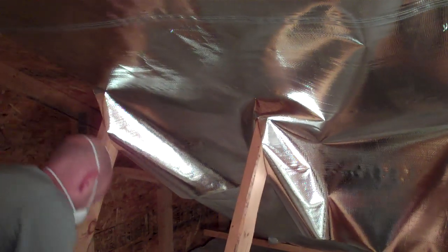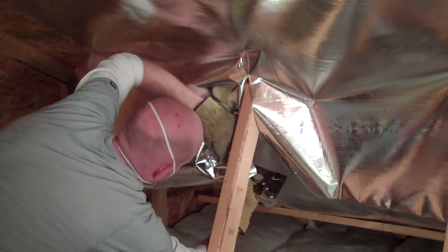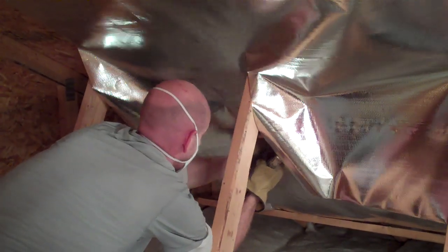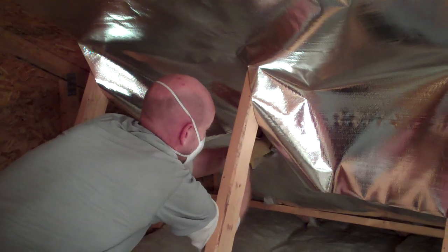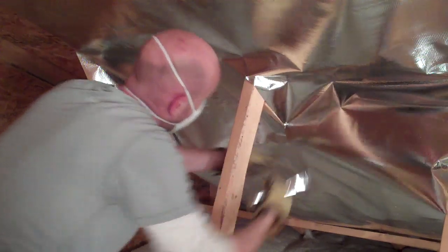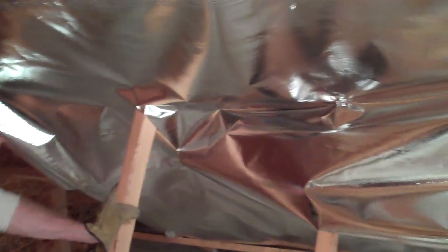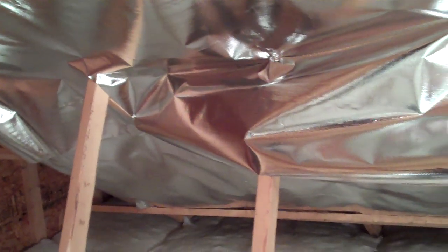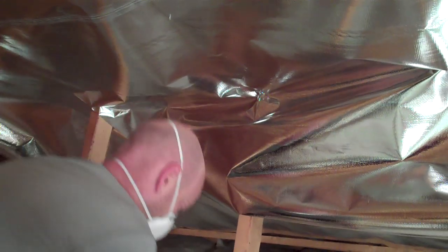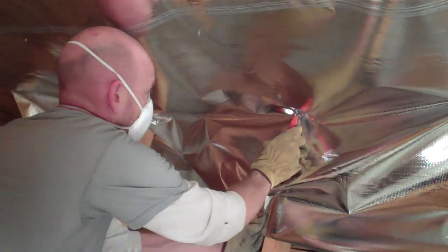Next we will come back and cut around the webbing. As you make the cuts, use a standard utility knife with a sharp blade. You can freehand the cut, but it's often easier to use the framing member as a cutting surface. After you make the cut, wrap the radiant barrier around the webbing and staple in place. Continue cutting and stapling around all the webbing. You can either cut all the supports out one at a time and come back and staple after, or cut and staple each as you go. Because movement is difficult, we chose to cut and staple each piece at a time.